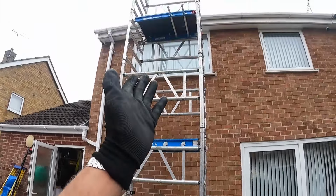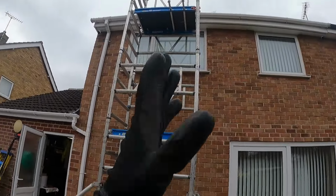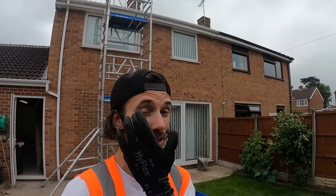Next I would set up the scaffolding tower, all ready to go. Try and figure out where you want it to be in position of the roof. So typically on a roof like this, you'd have two scaffolding movements: start at the left or start at the right and then move it once. It's a 3-bed semi, so it's not a long property. So yeah, only one movement you would need.